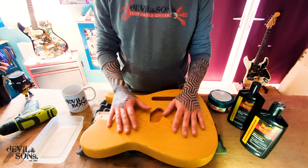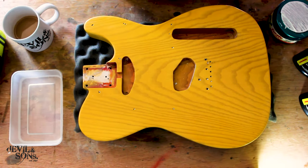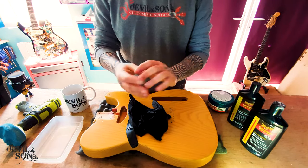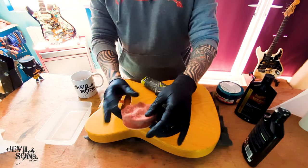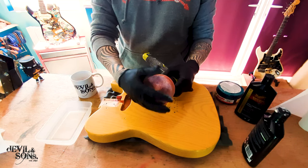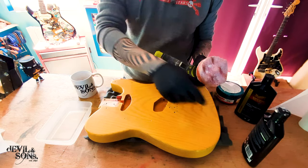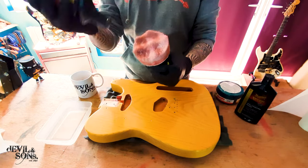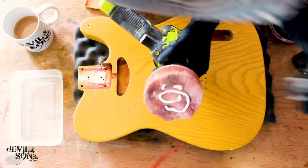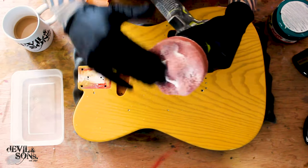The other things you need are some water. I tend to put the compound on and add a bit of water to help it spread as it's going around. I also always wear latex gloves just to keep my hands nice and clean. I've got my sponge disc marked 105 — the one I'm going to use for the first compound. I tend to keep a separate sponge disc for each compound so they don't get muddled up. I'm not sure it makes a massive difference, but this is a textured surface — you can get flat surfaces as well. I put the compound on like that, get my fingers a bit wet, and rub it over the surface.